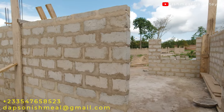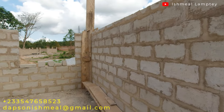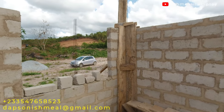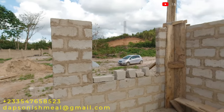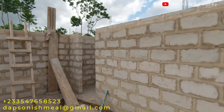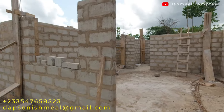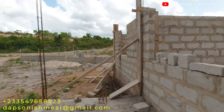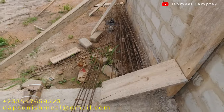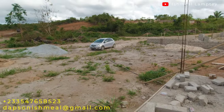So far this is the progress that has been made. What is left next is to have the lintel concrete cast — we've already done the steel for that which is outside. Then the woodwork will be done: a bin plate placed on top of the openings for the main entrance and windows, wood used to secure the edges, and then the steel placed in it before the concrete is cast. The steel is all ready to go on top of the building.